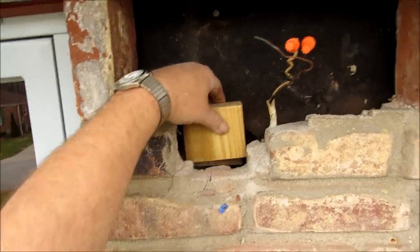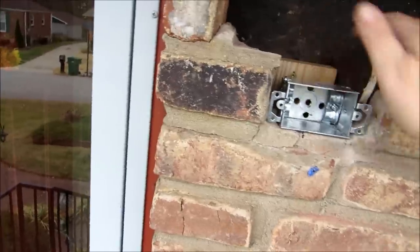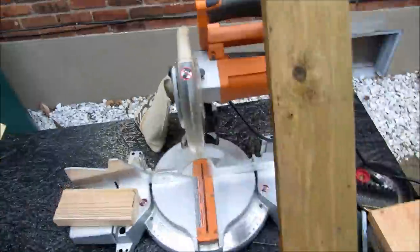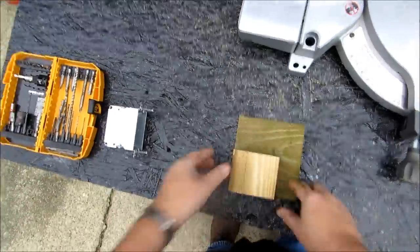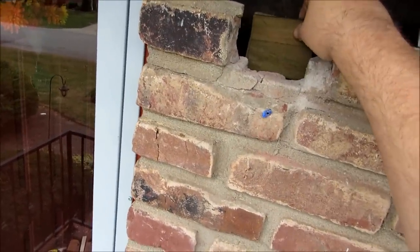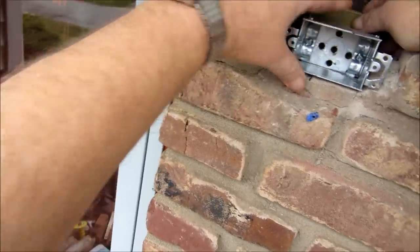I just want to see where that box is going to be sitting. I might have to put like a shim in there or something. We're going to be a hair short, but I can fix that too - that's what fence pickets are for. Okay guys, we got our 2x4 in there pretty good. It's not going to butt directly up to my box, but it'll get us a lot closer. Just maybe a sixteenth out or something, so we'll definitely want to pilot hole this.